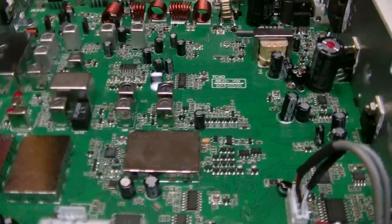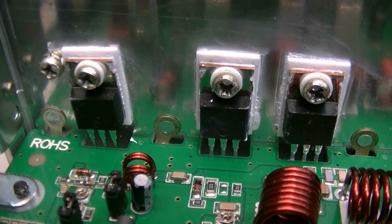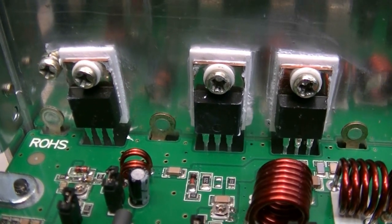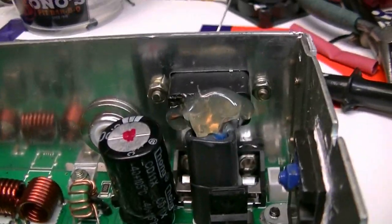It's been tuned. This one came from the factory with IRL 520s — they stopped putting the 13N10s in there because they kept burning up. So this one has IRL 520s and the bias has been set correctly so you won't smoke these. All the little improvements have been done, including hot glue on the back of the power connector to keep the pins from being pushed out.